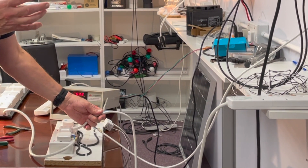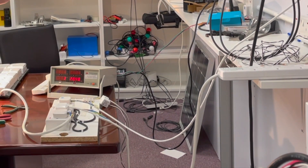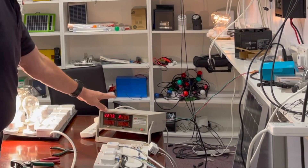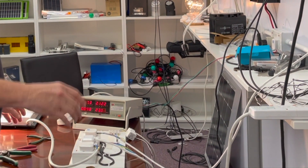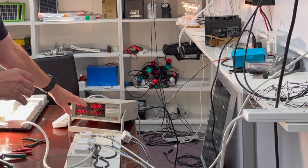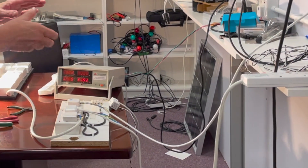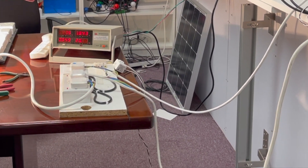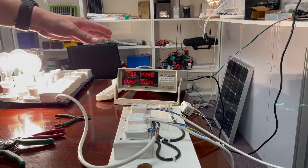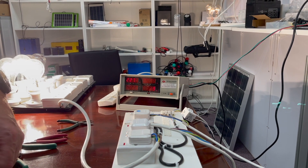I've put on my hybrid inverter here, and here is my load — this could be just a normal consuming load. As I say, I'm monitoring the wattage, so as I increase my wattage here you'll see what's going on. The mains takes a slight adjustment but I'm running about 20 watts. Now I increase here and you see my mains pull is still 20 watts — the energy is coming from the battery.